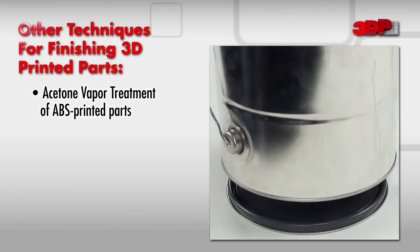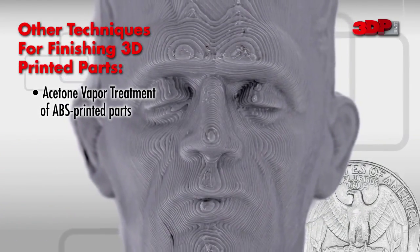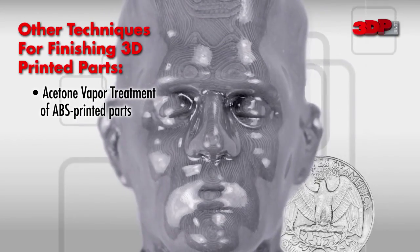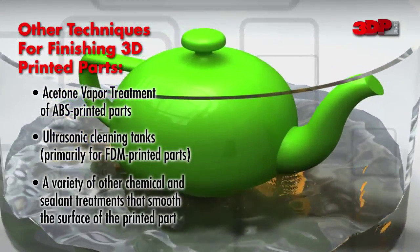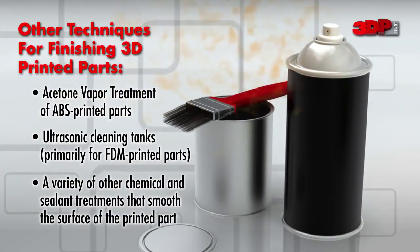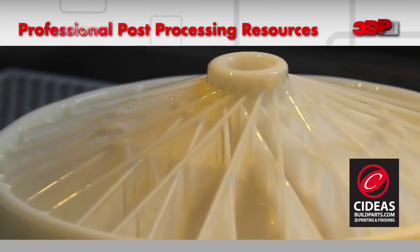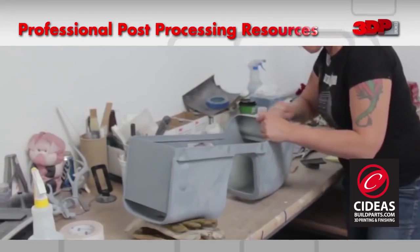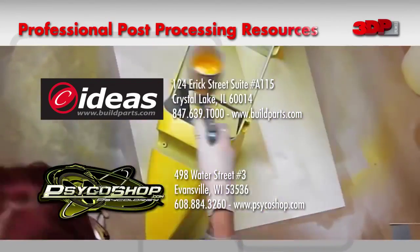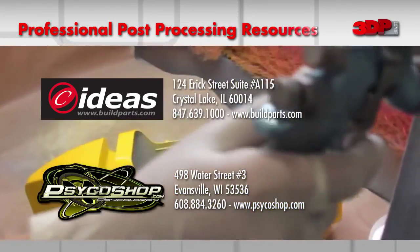Other techniques for finishing 3D printed parts include acetone vapor treatment for ABS, water and ultrasonic waves combined to remove support structures, a variety of other chemical and sealant treatments to smooth outside surface finish. It is important to understand that there are many post-processing techniques that can be applied to your 3D printed part in order to make it showroom quality. But you have to have the tools and the know-how to accomplish this, which quite honestly, not many of us have. Here at 3DP Unlimited, we trust the artists at Psychology in Evansville, Wisconsin, and the 3D print experts at C-Ideas in Crystal Lake, Illinois, to help bring our prints to life.